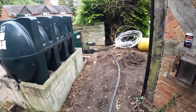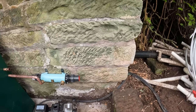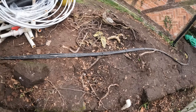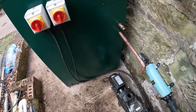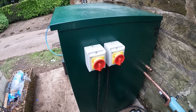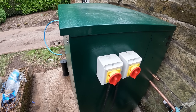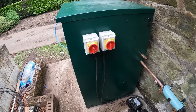Pretty much all done — all those armourings are done, just a few last bits and bobs to do in there. I'll show you it once powered up. The armour has come all the way around and I've left a little bit of slack behind there, cable-tied to the big chunky cable. Obviously all this still needs to be buried and fencing redone. Down here I've left it all loose with loads of cable ties for now, and mounted two isolators. The customer didn't want them fixed to the stone wall — they wanted them on this unit here, which the plumber confirmed was fine, so I've bolted and nutted that on nice and level. You've got a rotary isolator to the filter and a rotary isolator to the boiler. Jobs done — there'll be a part two, so thanks for watching!